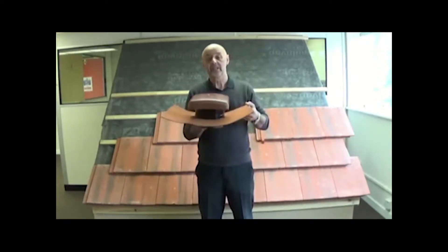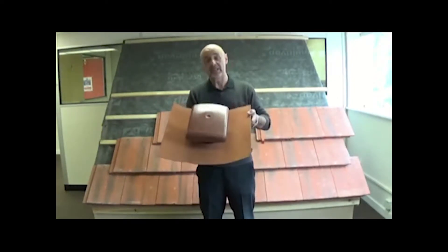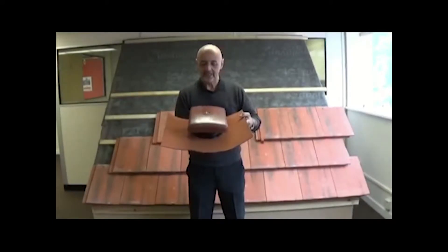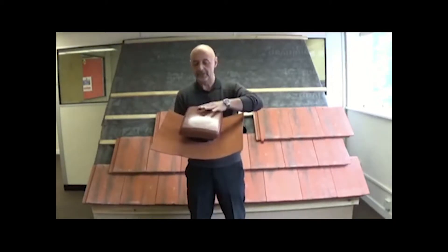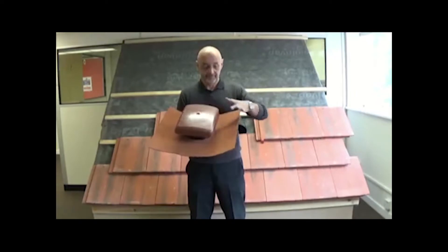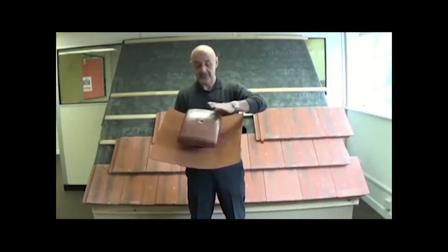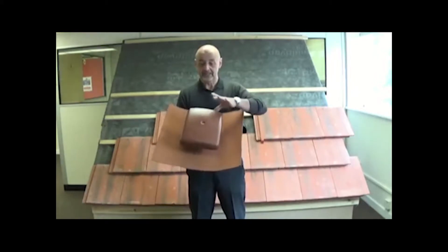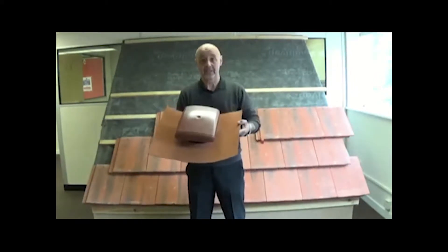It's designed to allow people to introduce it into a tile base that they're not too sure of. The UB-16 tile vent or the UB-41 tile terminal comes with a UbiFlex base and a boxed hood made of PVC-U. It comes in four colours: the red hood and the terracolour hood come with a terracolour base, while the sepia hood and the anthracite one come with a black UbiFlex base.